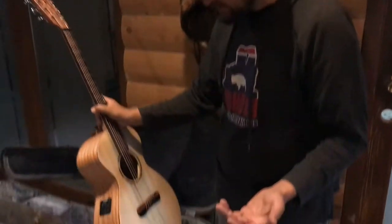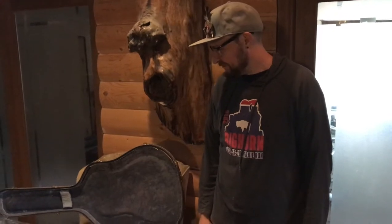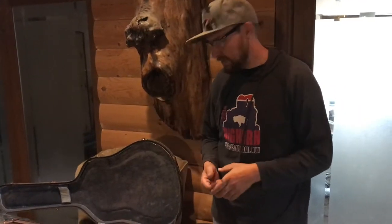But a lot of these materials on the inside are from 100-year-old pianos. To take the piano, we get them and we dismantle them, and then carefully, we used to carefully unwind all the strings, but now we actually just cut them all. And it makes a cool noise all the way through, and then we recycle the metal and take all the spruce, and usually the sides are made out of a pretty decent hardwood. And some of the other guitars are made out of those. The ash is usually the back and sides on those.